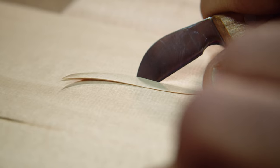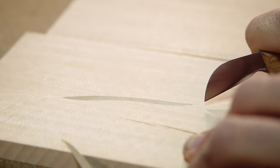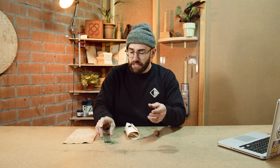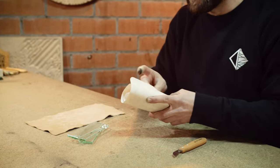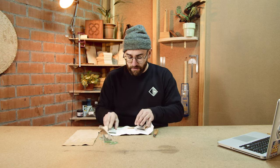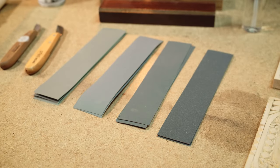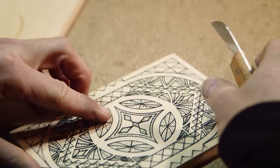Now that I've shown you how to sharpen a chip carving knife, I will give you some observations. If we have a knife that's already been sharpened, we can start sharpening from an 800 grit. If we have a damaged knife, we should start with a smaller grit, such as 400. We don't need to spend a lot of money on a sharpening system — with a glass tile and some leather, we are good to go, as you can find in my cheap carving kits. Each sandpaper sheet can be used once; as we sharpen, we remove the grit from the paper and it becomes less effective. As we are carving, if we notice the knife could cut better, we can always strop it every once in a while and it will improve the cutting experience.